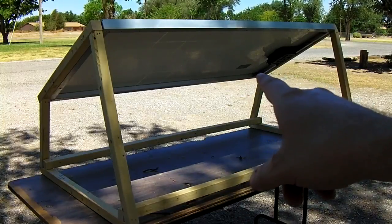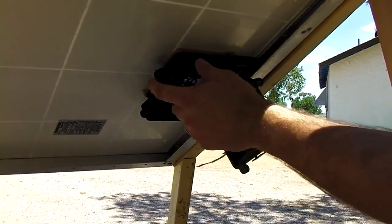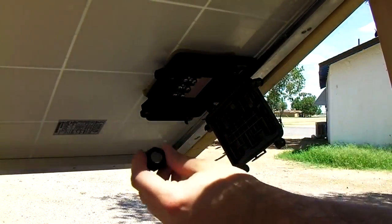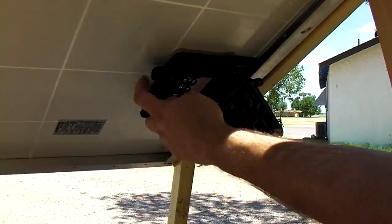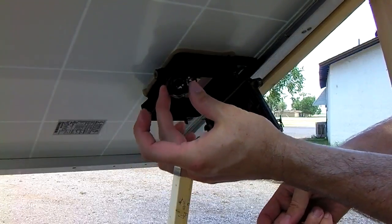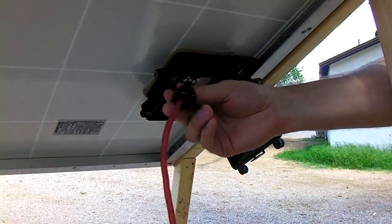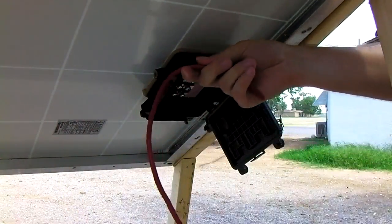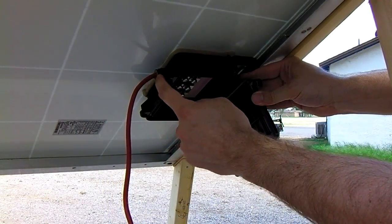Back up to the table to show you some stuff about how to wire this. We're going to need to get some wires into this junction box. Usually on the side of the junction boxes there's either a hole you can knock out, or it may have a weatherproof connector — basically a big nut that screws on, and as you screw it on it tightens an insert down that grabs the wire and makes it waterproof. Unscrew the retaining nut off the waterproof connector, insert the wire, and slide the nut down facing the proper way, down about as far as you're going to insert the wire into the box, then force the wire through the rubber waterproof insert.